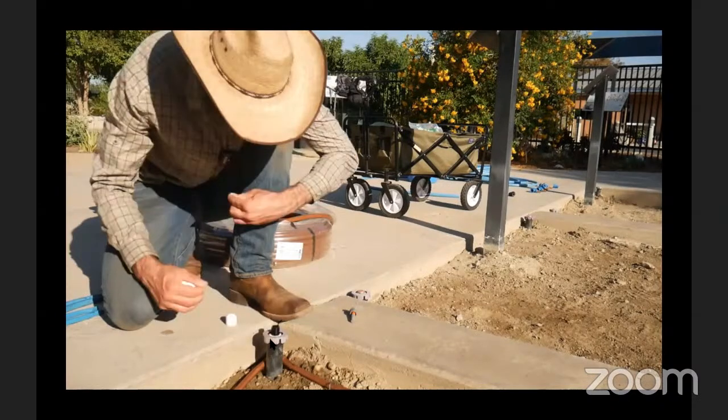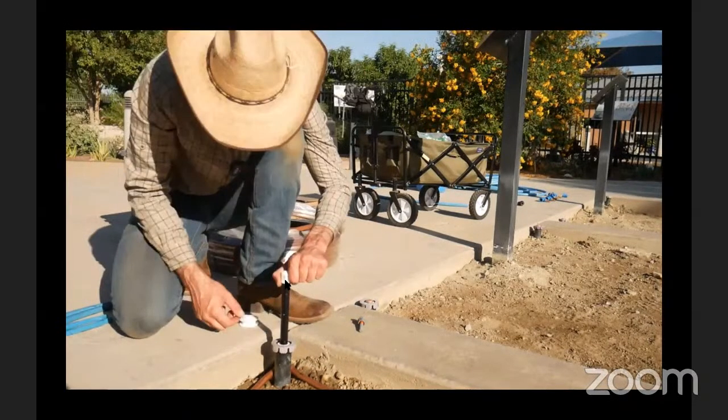And so you unscrew your nozzle, and you put on a little adapter. It's kind of the reverse of the shrub head adapters. You put on a little adapter that will screw in like it was a nozzle, but on the other side, it's just a half inch pipe thread. And onto that, you put your tape and you put your half inch cap that just threads onto it, so it doesn't let any water come through.